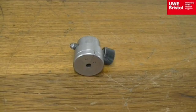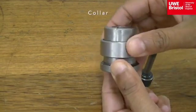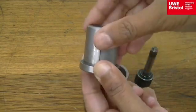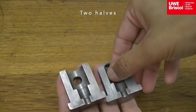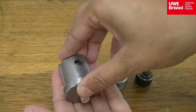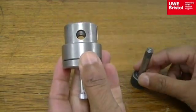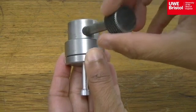To fit the specimen into the collet, the four parts to be disassembled are: a pin, a collar, and then open up the two halves in which the specimen will fit. It will fit in the slots here and protrude through the large face of the two halves. Close the two halves, place the collar back on, then place this collet onto the machine. This pin is a locating pin which will fit through these holes and through into the machine.